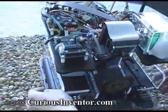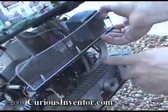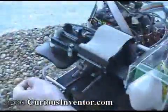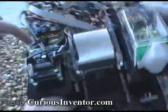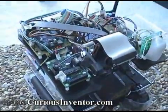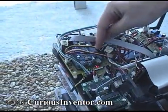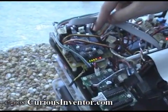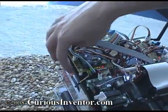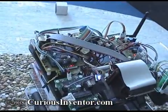We have an identical motor driver here which controls the driving wheels of the robot. Does it have amps on it? Yeah — those are the drivers, they're H-bridges. So this is the main brain: it's the Motorola HCS12X microcontroller. It's got this connector board that it sits on, which we custom designed so that all our components can plug into it.